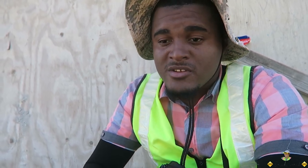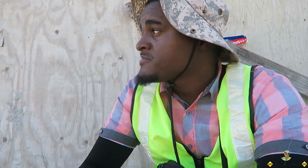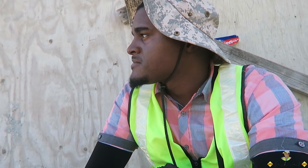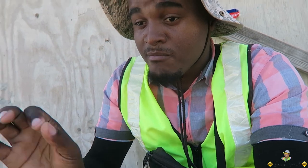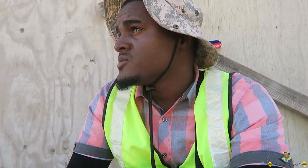They recommend applying the second coat between 12 and 36 hours after the first coat. No rain, not too much sun, preferably in the evening. Yeah, I think we did go through how the application goes. As I said, for the first coat, because we know you have some type of roof compound, and I recall the brand, don't use it straight for the undercoat, mix it with water. When they say water base, you can mix it with water.